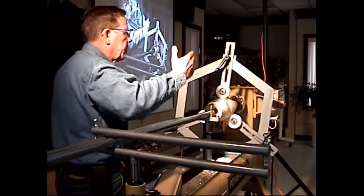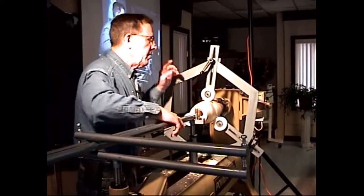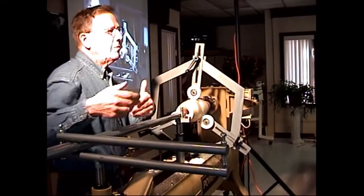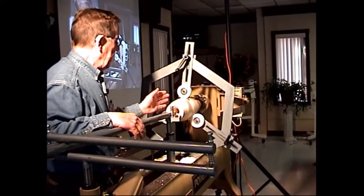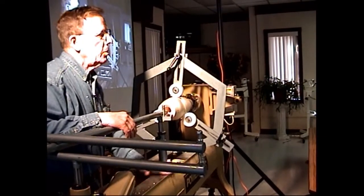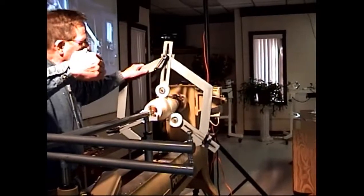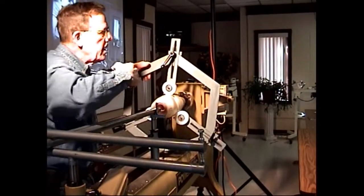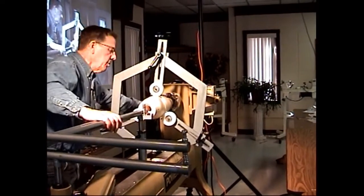The problem with going in and going out to the edge each time is that your brain is not very good at calculating exactly how far out you're coming each time. If you mount the laser up here, you can see where you are. But if you don't have a laser, and one of the guys who worked with me quite a while just loved to do it that way, and I kept arguing with him, he'd go through a lot of vessels because he'd get in there a ways and then whoops, a little bit too far. So if you go in just like that second cut I made, going along the inside the long way, your brain can calculate much more accurately how close you are to the outside edge.